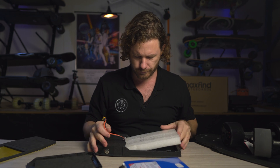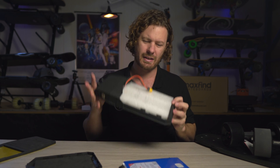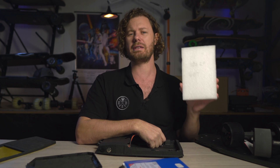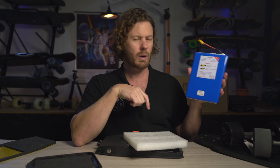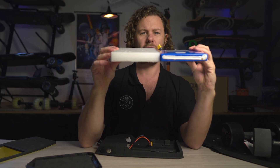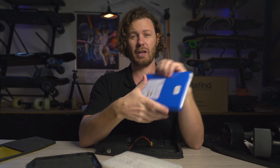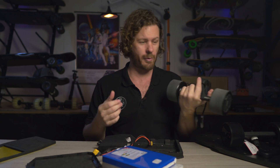Guess what? It fits. The key point about this 40T pack is it's rated to output an impressive 75 amps, where the original pack is limited to half that current output. Not a huge difference in the physical size, but much more power output. That's key if you're going to upgrade your motors later or if you just want more performance.